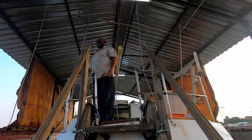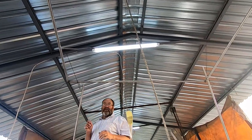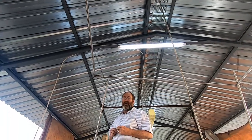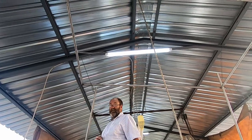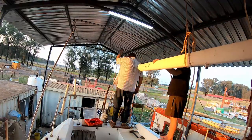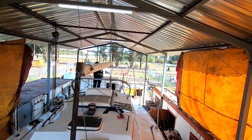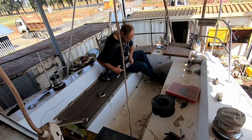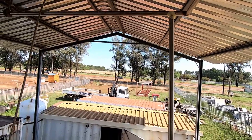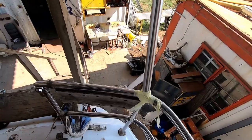What have you been busy with while I was away? Busy playing around with the frame. They welded the back frame. Let's line it up and see if it's all square. No, that's 1.2 — it's going to overhang. Okay, let's mount it. That's the basics of the frame we've got together now — it's all level and doesn't look too bad. Now we're just going to tack it with the CO2 welder and the stainless steel wire before we put in the frames on the sides.